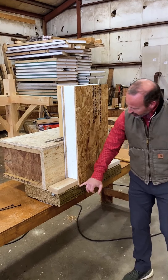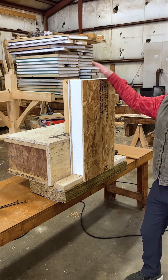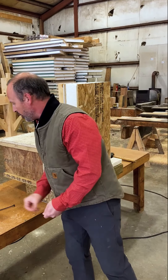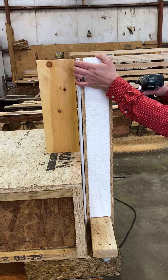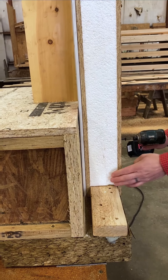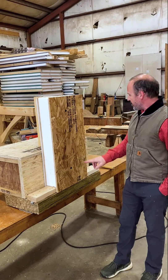We do want to make sure that the SIP is all the way down. We will install SIP screws through the SIP into the rim board and into the post, and all of those fasteners hold the post to the rim board, to the sill plate, to the foundation. That's what keeps the building from tipping over when the wind blows and locks those posts into place. Our typical screw spacing is somewhere between eight and ten inches through the SIP and into the timber frame and into the rim board.